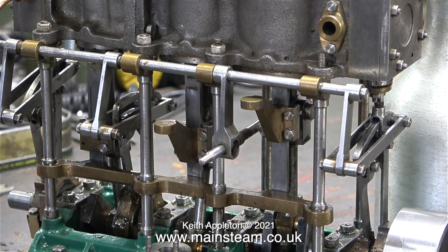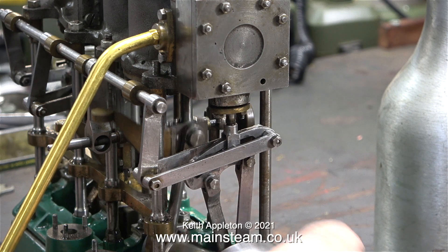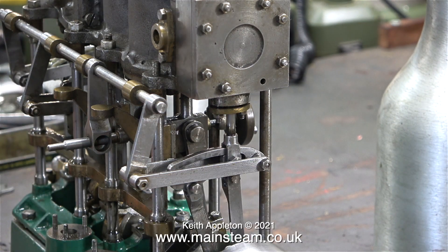As you can see the engine runs ok — it's still only running on the high pressure cylinder, but it will only run in one direction. I haven't taken into consideration the 30 degree offset of the eccentric sheaves, which are made as a pair. I'm very concerned about the oil supply, so every time I run the engine I inject some oil into the other cylinders that don't have an oil feed.